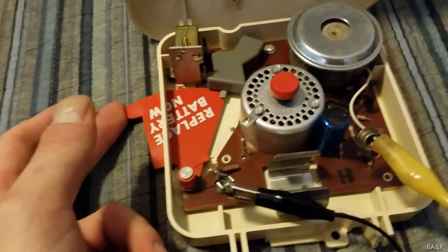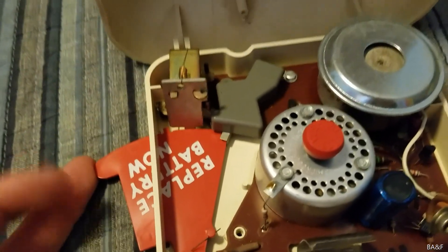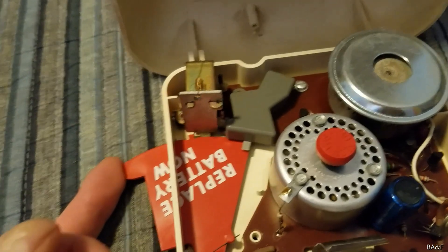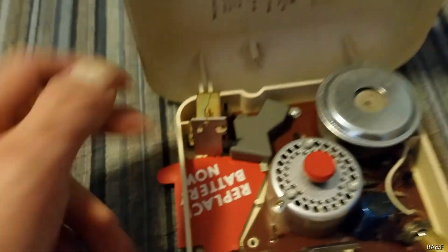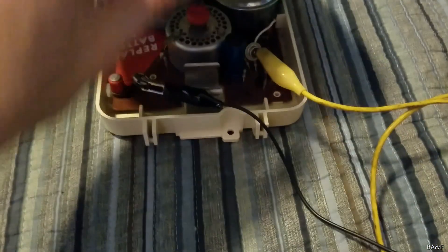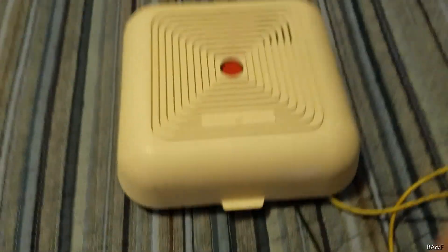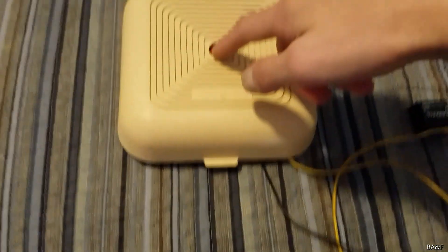You'll also get to see the battery flag in action. When I push the battery flag in — see that? When it hits that metal tab, the electromagnet diaphragm goes in. You can push it in and then it comes back out, which allows you to reset it without messing with the diaphragm. I'll close the cover — not snapping it all the way in — and we'll test it.